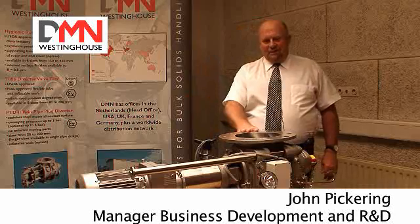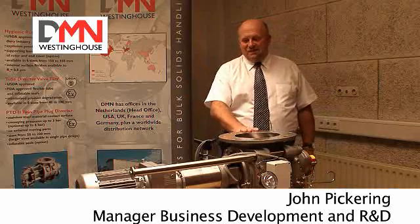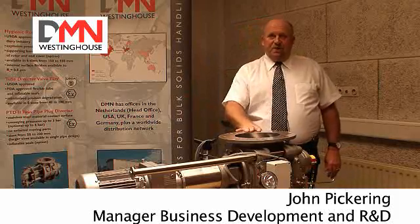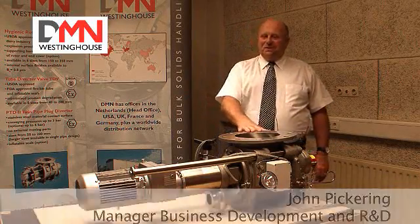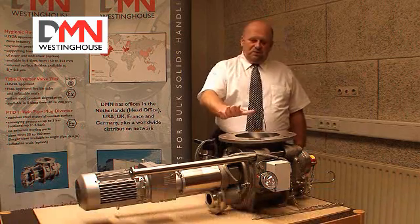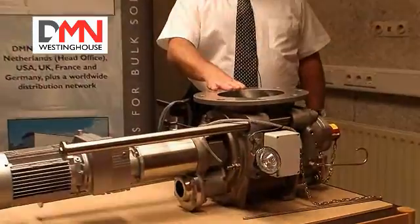The MZC valve is available in different configurations, ranging from cast iron to stainless steel. It is very often used in the pharmaceutical, food, or industries where cleanability is an issue, or it is necessary to clean the valve when changing colour or going over to a different product.